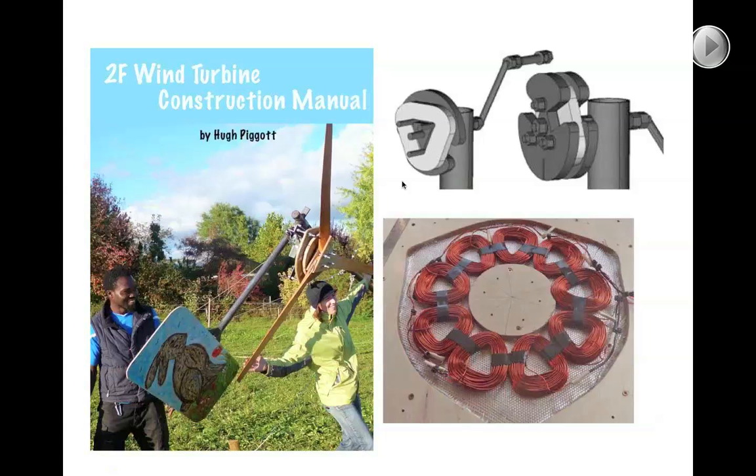What you'll notice most about the stator is the completely different coil shape. Rather than attempting to make a coil where all of the flux from the magnet passes through the center, when you've got magnets so crowded together the geometry changes. It becomes preferable to have a fairly small triangular hole in the middle of the coil and pack a lot more copper into the stator. This design has proved very successful and I can get very good efficiencies despite using the lower-tech ferrite magnets.